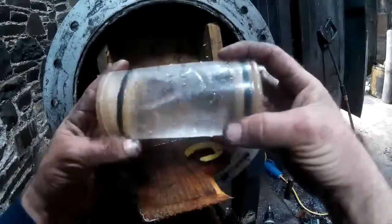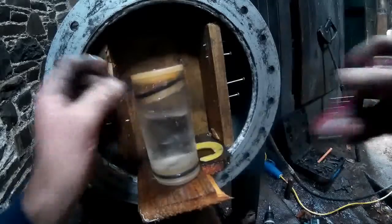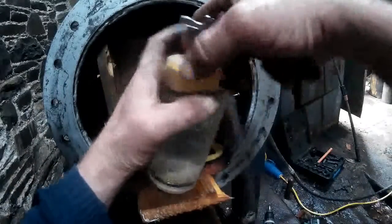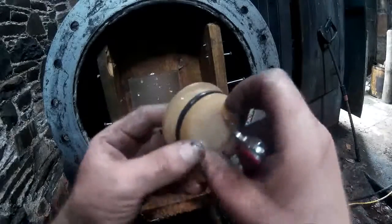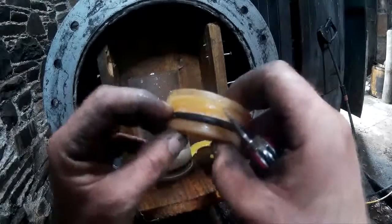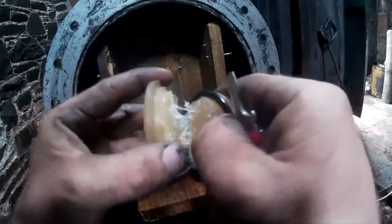Oops, for this one, well, it has delaminated along the line. So one of them, I was wondering about when I was making these, how destructive the process of removing the mould was. So these I had in acetone for nearly 2 hours to soften the high impact polystyrene. So it might have affected the strength of the GRP.